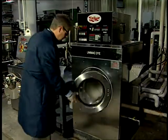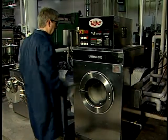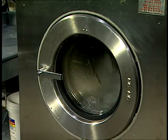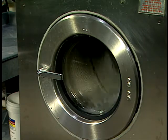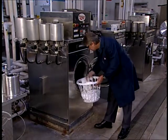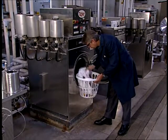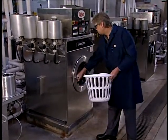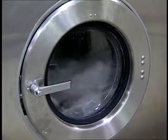The same machine is sometimes used for more than one process. For example, scouring, bleaching, dyeing, enzyme treatments, softener application, and other processes give the sock manufacturer many options. Rotary drum machines are versatile and accommodate a wide range of sock types and chemical processes. As such, they're often used for a variety of products and wet processes. Machines range in lot size from a few pounds to hundreds of pounds.